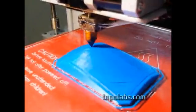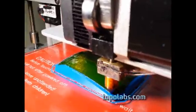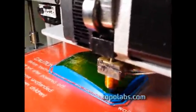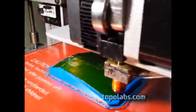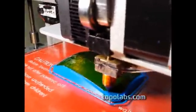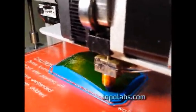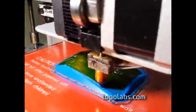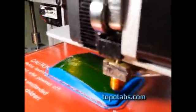Once the support material has been finished, you typically add a release layer. In this case I put Kapton tape on top of the support material in the middle, as you can see there. You can also use hairspray or a variety of other easy release materials. What that does is it just keeps the material we're adding to the top from sticking to the support material, but it does stick to the outside layers.